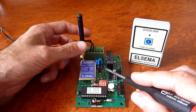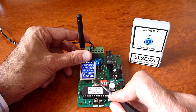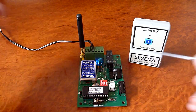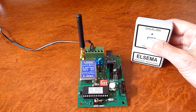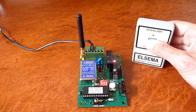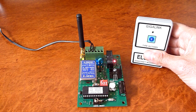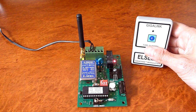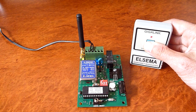The next mode is flip-flop. You enable that by flicking dip switch number one on. When I press the button, the relay will come on. When I release the button on the remote, the relay still stays on. You need to press it a second time to turn the relay off.